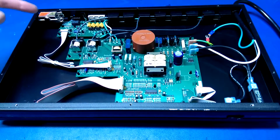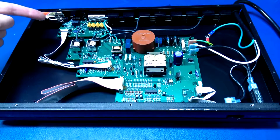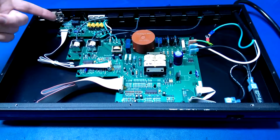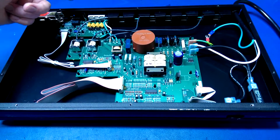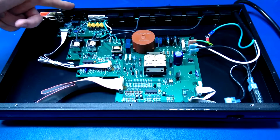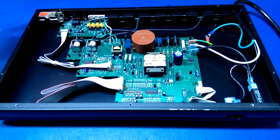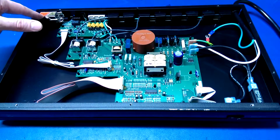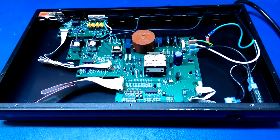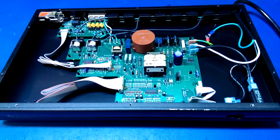On the back there's another little daughter board with surge protection for the phone lines, a relay, and an opto-isolator for the communication protocols — simple serial communication and a relay-switched output for turning on equipment. There's also a coax surge protector, which is just an off-the-shelf unit screwed into the back. Kind of funny — both of those features are basically obsolete now, though the cable connection is still applicable if you have a cable modem or cable TV.